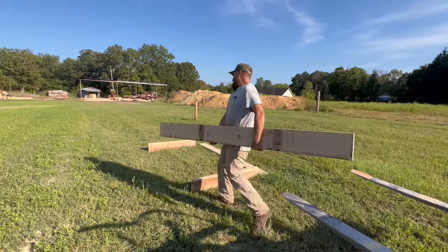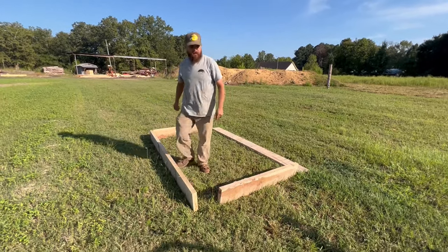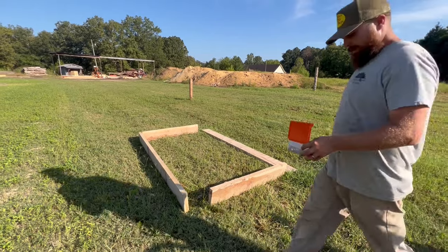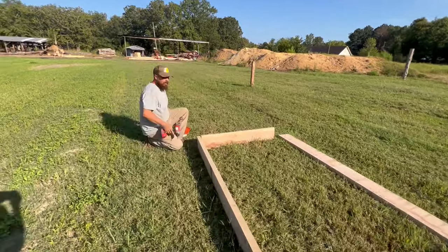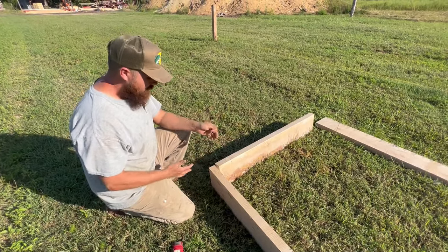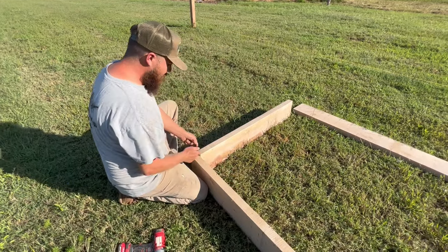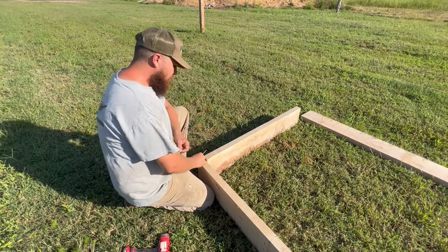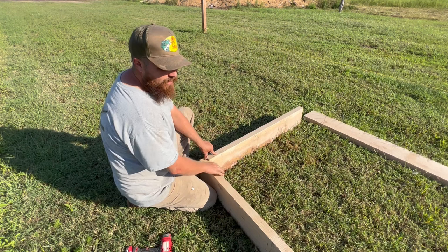All right, I'm kind of mocking them up out here, getting them into somewhat of a position. Our ground's relatively flat, so no big issue there. And what I'm gonna do, I'm not using any corner pieces. Some commercially available timbers you buy are 1.5 inches, right? And they don't have enough structure, or 1x sometimes people use, to do what I'm about to do. But since I'm using true 2-inch on hardwood, we're just running 4.5-inch screws without putting anything in these corners. They won't be needed for what we're doing, because we're building these heavy out of a heavier type material.